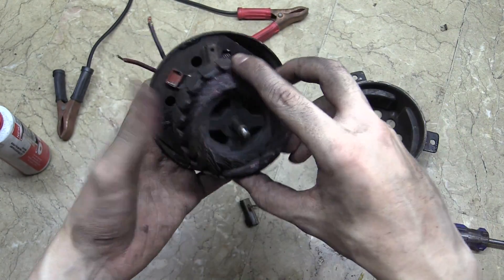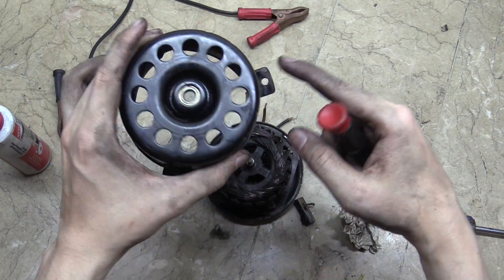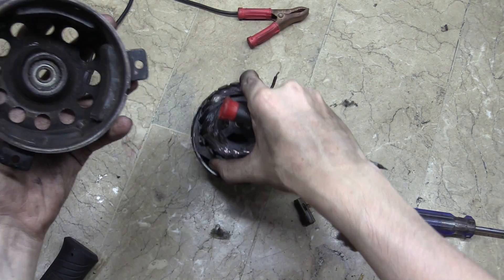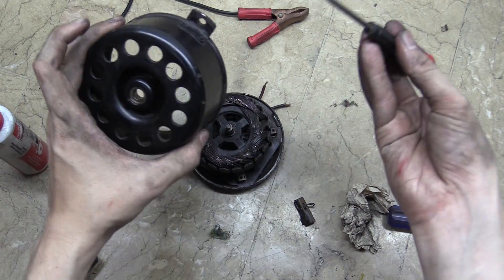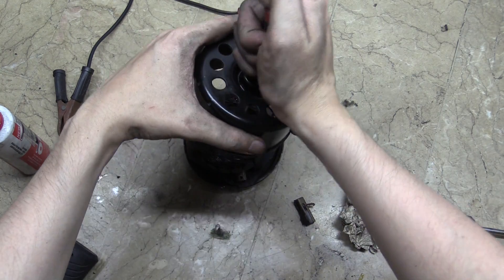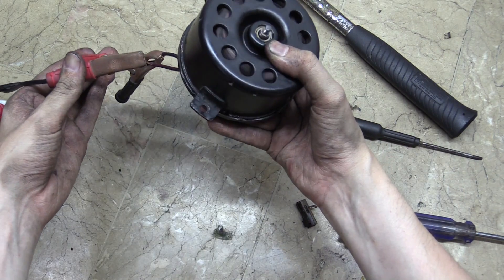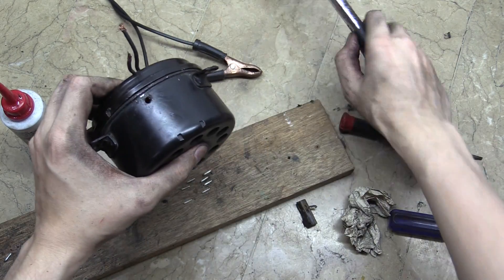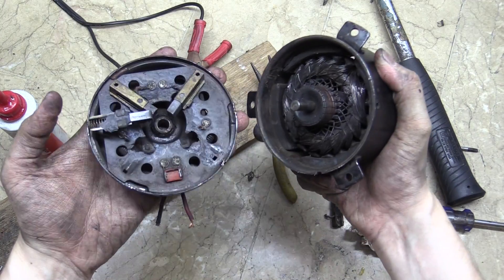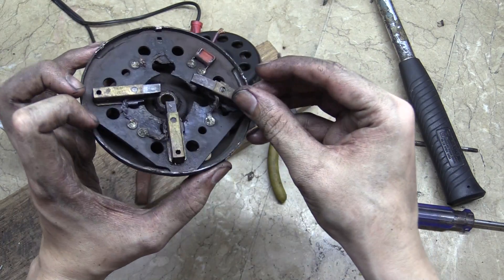Like I said, I really have to replace that board, but it is working even with just three of the brushes. When you try to put the casing back on, it's going to pull the rotor violently up and most of the time pull it out of the brushes. What I've been doing is putting a screwdriver through and using that to push down on this to hold it in place. I'm pushing down, and hopefully that is now locked in place and this should spin. Then I use a little bit of brute force to get the case back together. And another brush has broken off — this board is just so old it's no good anymore.